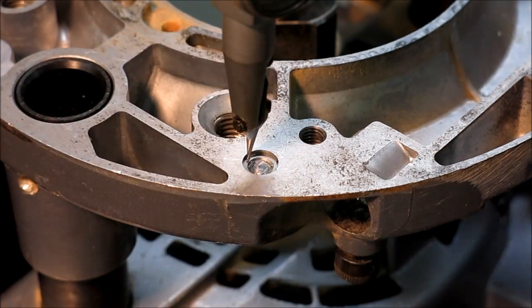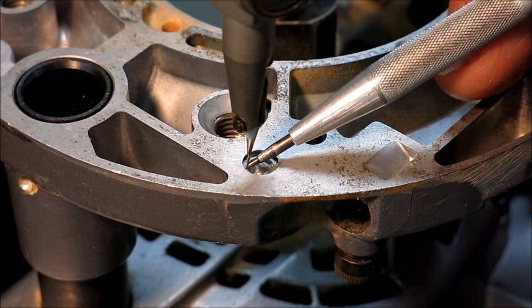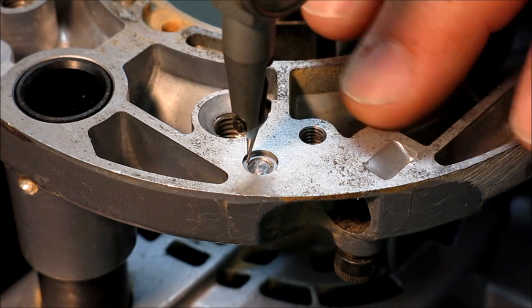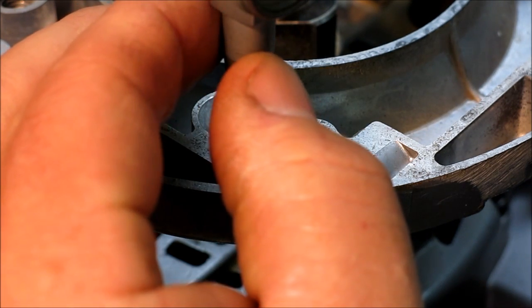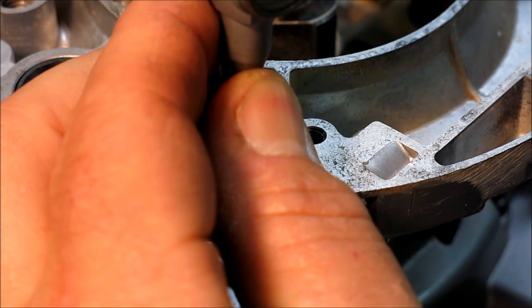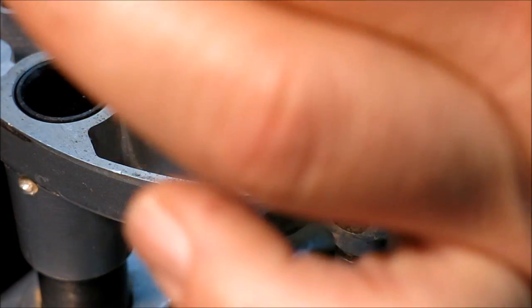Let's get up close. I have this little tiny counterbore here. It's probably, I don't know, a millimeter deep or something like that. So I'm going to sweep that little edge there. And for those of you that use edge finders to find the centers of holes, let's see you do that one. That's a tough one to do without chewing it up with the edge finder too. So let's see here. Now you can't see the dial, and it doesn't really matter for what we're doing here.